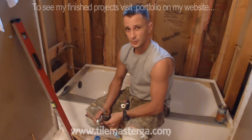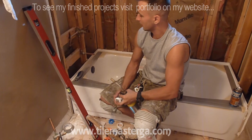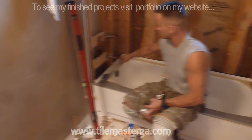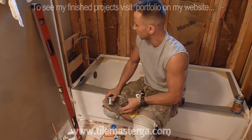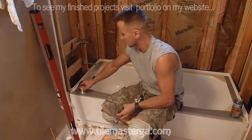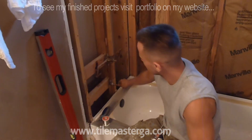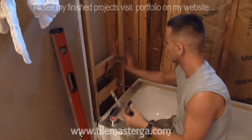We're on day two of the installation. What we did yesterday: I cut out the entire valve and replaced it with a brand new Moen piece. We rearranged the setup a little and did the water test. The shower valve has been exposed for almost 20 hours now with pressure on to double-check for leaks — because if there are any, it usually happens in the first hours when water penetrates imperfect joints. In this case, there's no leakage — everything looks very good.